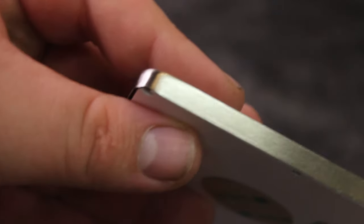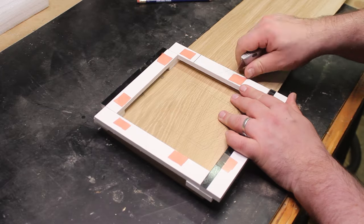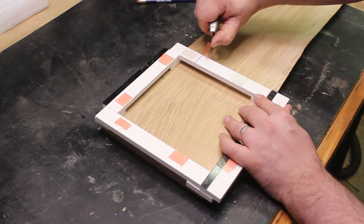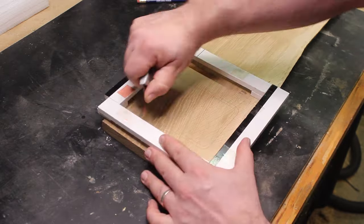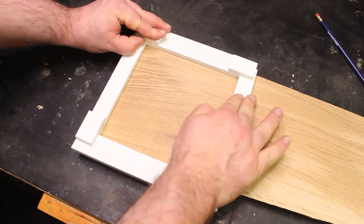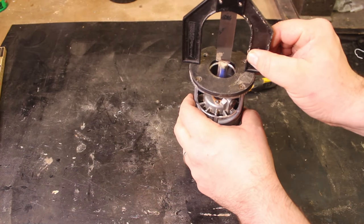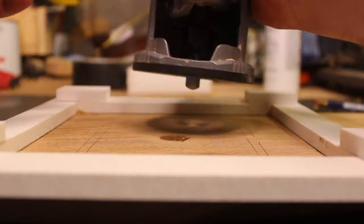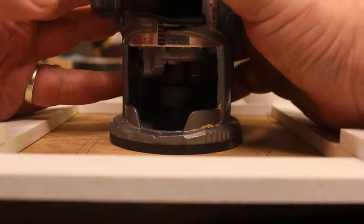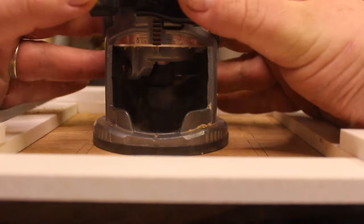I need to work out the thickness of this. It's about eight millimeters, and what I've done is used some 10mm foam board just to make a template for my router. For my router it needs to be 38mm bigger than whatever I'm trying to take material out from. I then set the depth of the router — I'm planning on doing this in a couple of passes — and use the router to hollow out the middle, knowing that the foam board isn't going to let me go outside the lines I need to stay within.